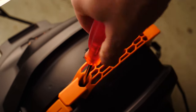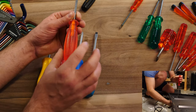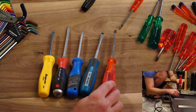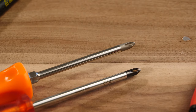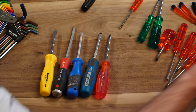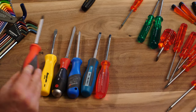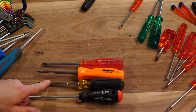They're just sort of universally the same thickness — the middle is a little bit thicker, but not toward the tail end in a light bulb fashion like the rest. These are just made for a different kind of application. The PB Swiss, aside from the Snap-on, probably has the shiniest chrome vanadium finish. The Vessel, the Godori, the Wiha, and even the Matco all have a matte finish — maybe it's just a German preference. I would say the PB Swiss looks the closest in metal finish to the Klein, with a similar shininess.